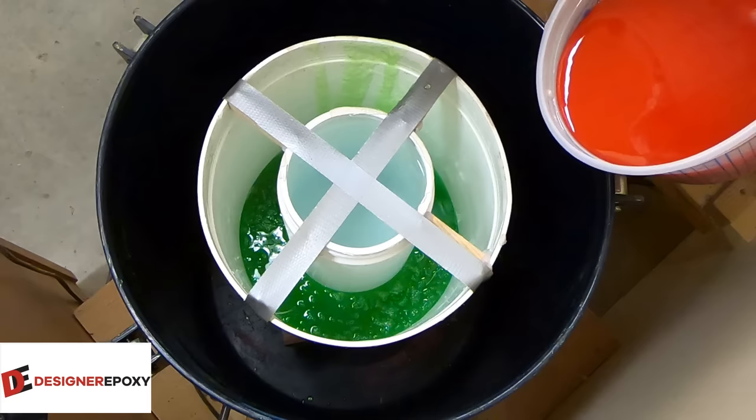Now that the glue is set, we're able to trim this piece up. Just taking some very light cuts here. Again, this isn't supported. Being aggressive here could really harm you. I did leave a fairly decent size waste block on the end of this, so I'm fairly confident that there's not going to be anything bad happen here, but if you do happen to get a catch, it could definitely be catastrophic, that's for sure.